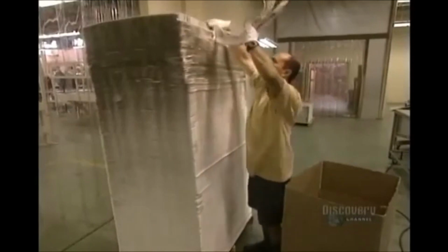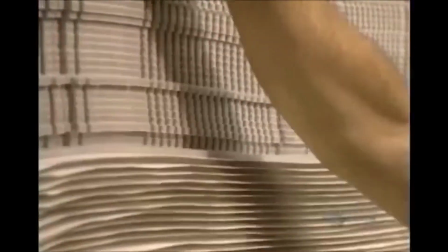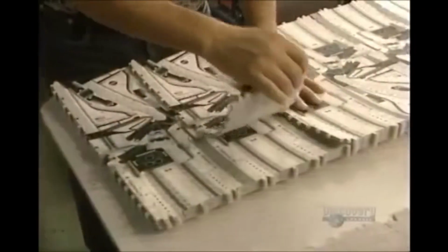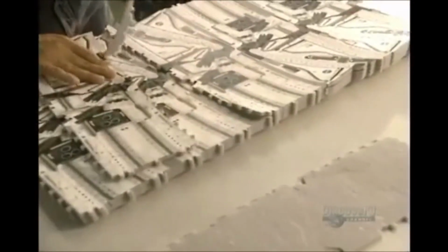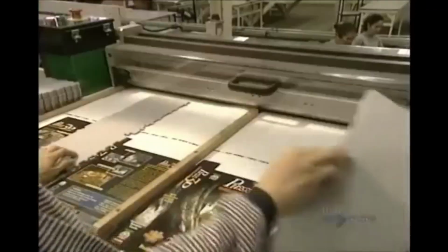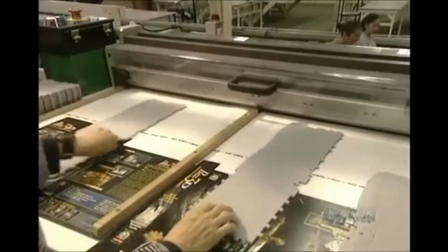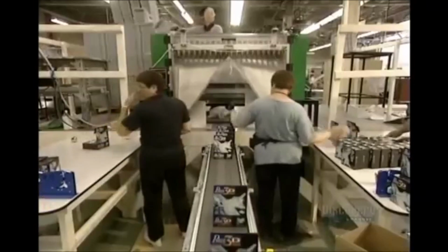Once the adhesion is finished, the puzzles are stacked on one another, and they proceed to the unbuckling operation. By pulling, they remove the surplus cuttings. The same design is printed several times on a sheet, so they must separate each puzzle. This step is called the reduction of the models. Now the pieces have to be separated. This decorticator handles this task and sends the pieces down a chute.